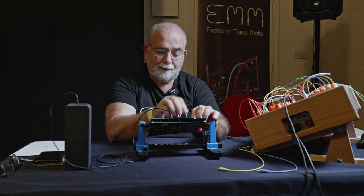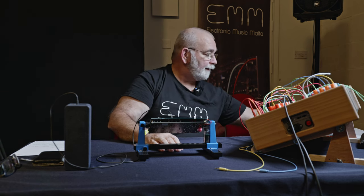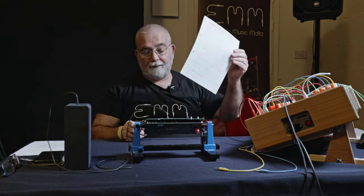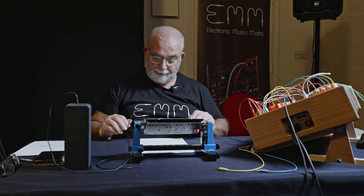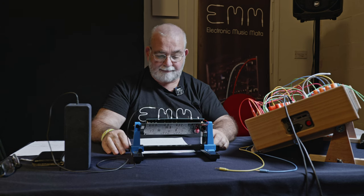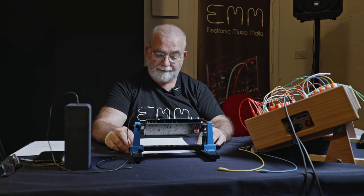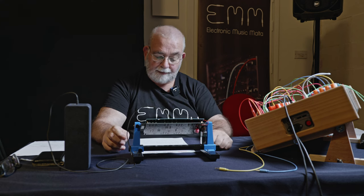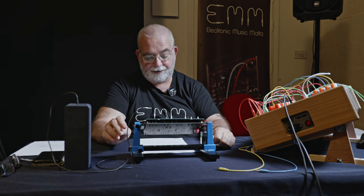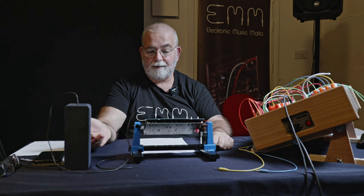The second mode into which it can be driven is called the wavetable oscillator mode. And please bear with me, because I am going to give you a whole course on wavetable oscillators on a single page in a couple of minutes. Basically, a wavetable oscillator is a digital entity. It involves a central processor, which accesses a library of values on certain memory locations, and it uses the values found there to generate its output wave.